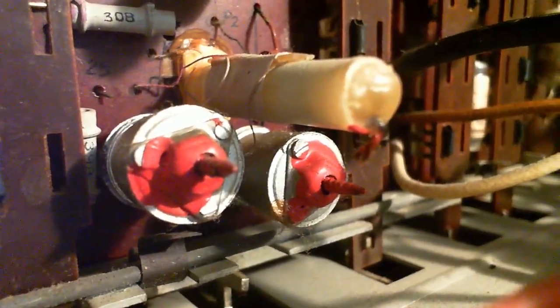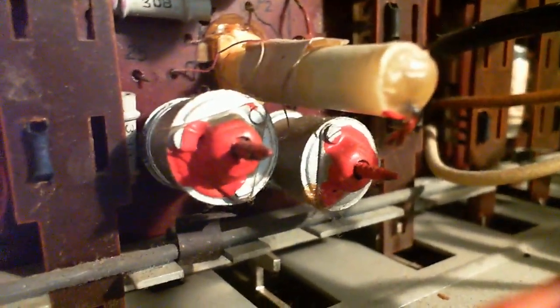Okay, over here, the far side, we're looking now at the fuse, which appears good. A big transformer here, filter capacitor, and then there's probably somewhere over here some diodes. I don't see any. Maybe not diodes, but a little box, though I don't see a full wave rectifier in it. There's some more adjusting things. Look at that. Well, maybe we don't have to adjust anything. And I'm not sure the owner has even turned this radio on. He's quite worried about that.